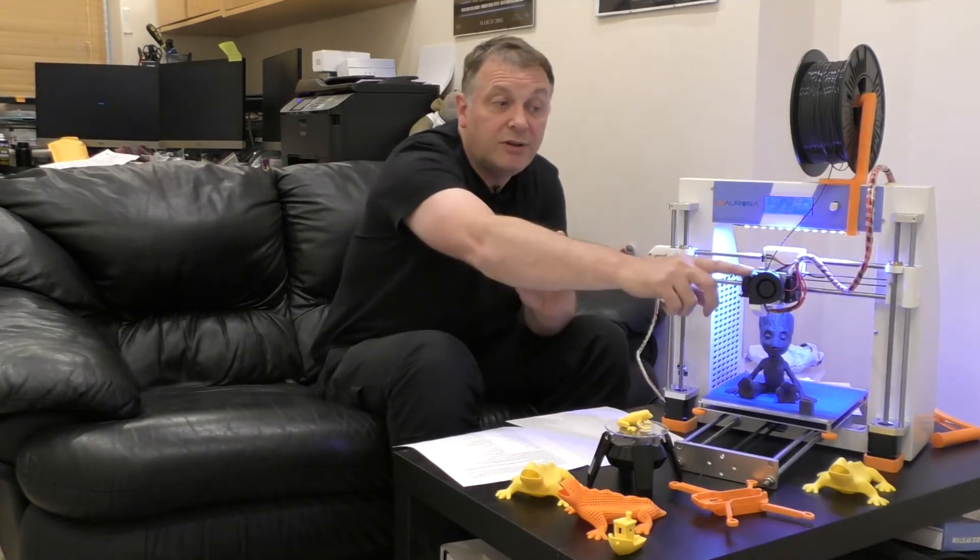The actual bed size is 200x200 and it's a heated bed - it'll go up to 110 degrees Celsius. It's got a single nozzle extruder and that'll do up to about 250 degrees Celsius. It's also got a really good PLA cooling fan on it, and you can actually link that to the software so you can turn it on and off depending on whether you're printing ABS, PLA or whatever. It also says it'll do wood. It's compatible with open source software, including the freely available Cura and Repetier Host. The assembly instructions weren't bad - I'd certainly recommend checking out everything on the SD card, especially the PDFs.